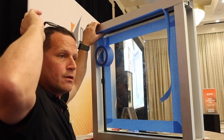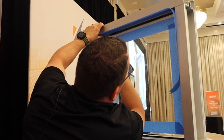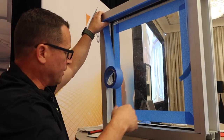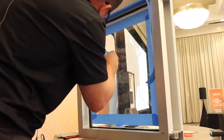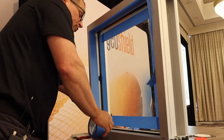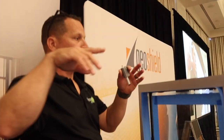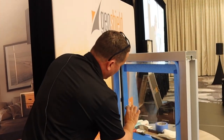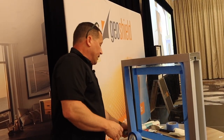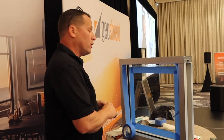What were the two sizes of the beads that you mentioned? So the bead size — we have a three-quarter inch bead, which would be for your windows that have like a really hard seal and the glass is closer to the frame. We've got 13/16ths and one inch. And I also have a small five-eighths for those small window frames where you can barely get anything in. You always want to do the largest bead possible. The whole goal is if you can't get the right size bead on there, at least put the largest bead that you can on it. The easiest way to determine is to take any of your tools, put your marker in it, and see where it lands. If you can get tape on the inside edge just a little bit, that's the largest one — that's the one you go with.